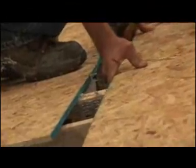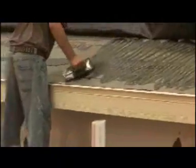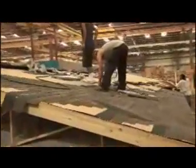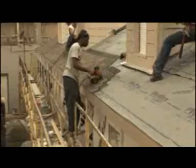In most cases, long threaded rods with large washers and lock nuts are required from the roof, down through the wall, and protruding from the bottom of the floor framing to meet high wind conditions. Roof decking of 7/16-inch OSB is installed using expansion H-clips, and then the entire roof is covered with a 30-pound roll of felt shingle underlayment, commonly called tar paper. High quality, 20-year, 210-pound 3-tab shingles are now mechanically nailed down to comply with the 120 or 140 mile per hour wind load requirements.